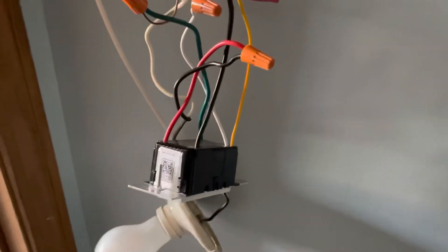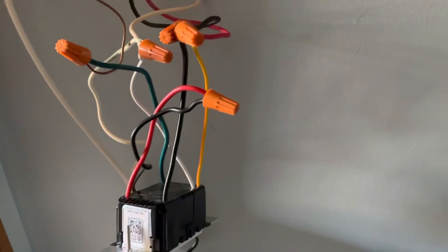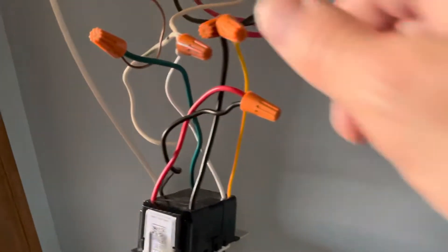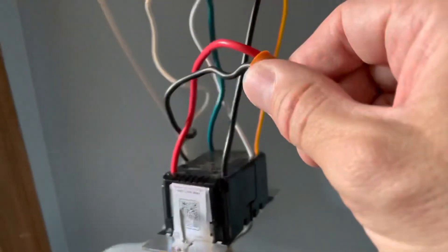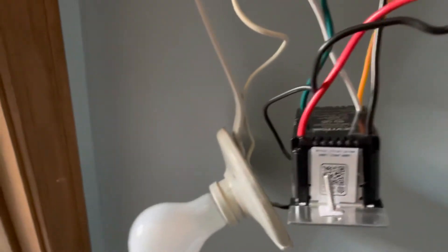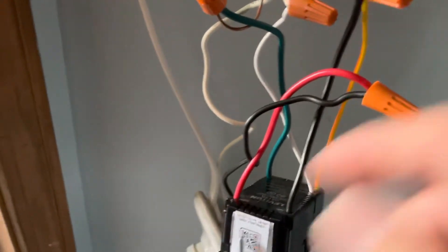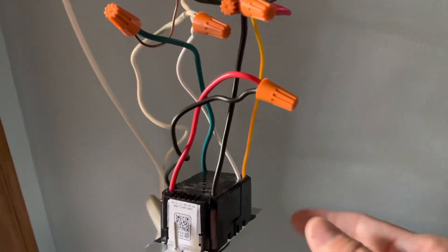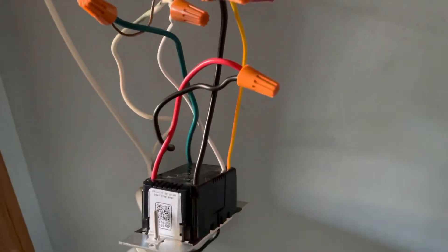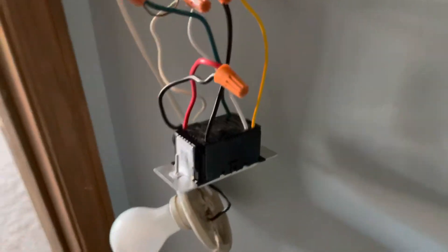The connection part of all this has befuddled me for way longer than I'd like to admit. The black wire coming from upstairs comes in here. The black going out on the load connects to the red. The whites are all tied together, and on these Leviton smart switches, you absolutely have to have the white connected to the switch itself — you cannot just tie it together in the back of the box. Then the red coming out from the other switch goes to the yellow-red on the smart switch.